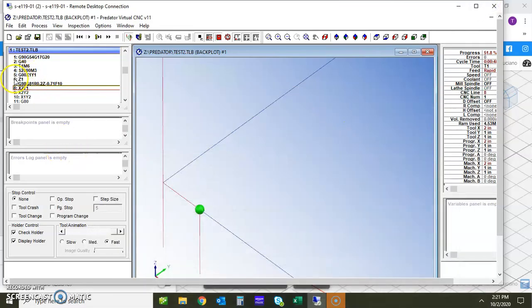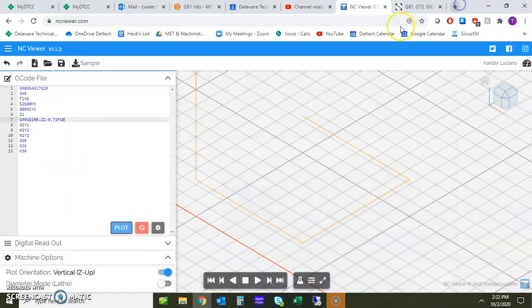So we're able to go down and come back out not at an R value, but actually at the initial Z height. Now, why would we want to do something like this? Well, quite frankly, if you have some clamps on top of your workpiece, you may want that additional safety, so you can make it come up a little bit higher, or at that rapid 2 to get around some obstacles. So it is definitely helpful, but it's very important to remember which one you're actually calling out. Okay. So again, that's some good stuff there.